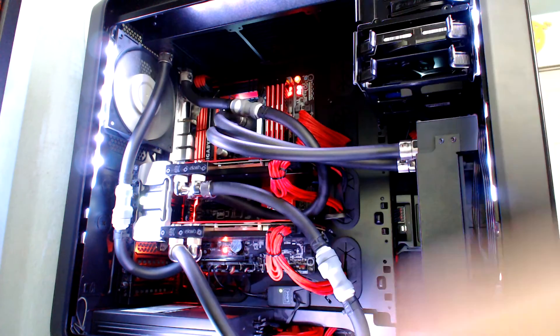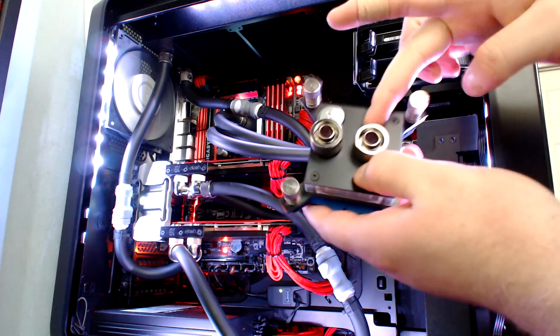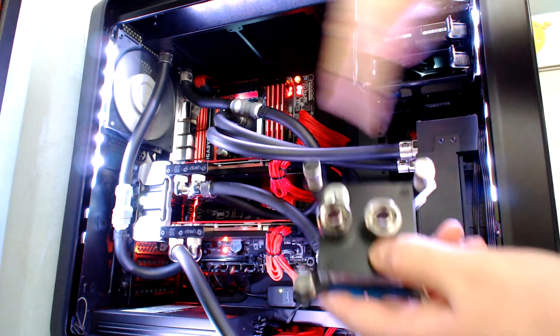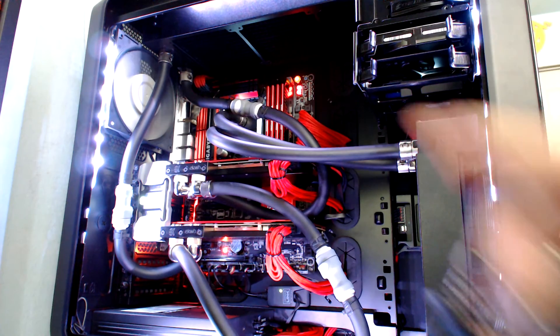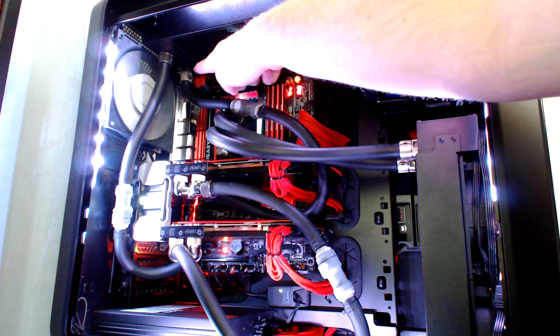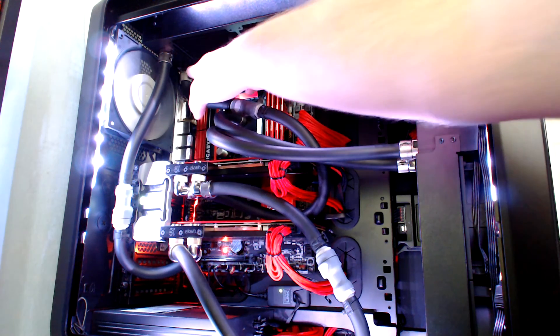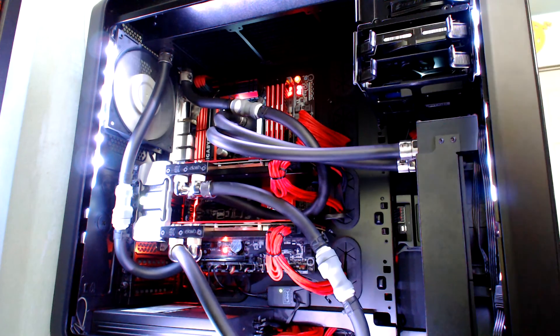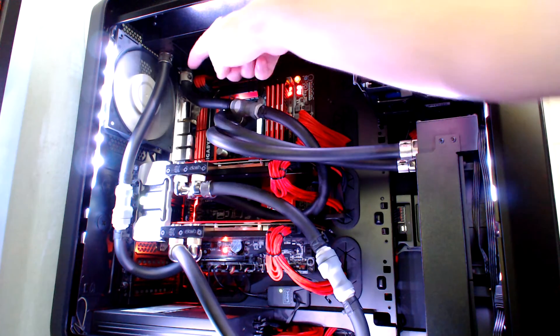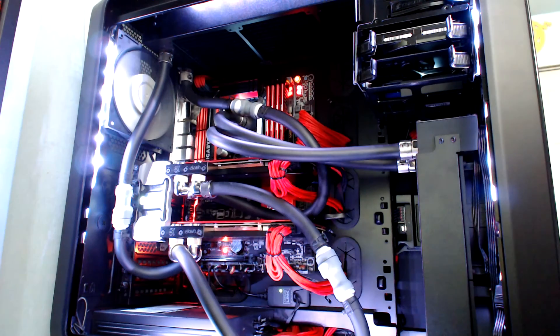You could just use a compression fitting without a rotary — take the same fitting attached to the smaller hose and attach it directly to the pump port, then finger-tighten it. Don't over-tighten, because it's plastic on the pump. The rotary fittings need a wrench because you have to spin the threaded part into the pump — if you just spin the outer part you're spinning all day since it rotates, that's why it's called a rotary fitting. This whole tube in the back came off of that part right there — that's the only piece I changed.